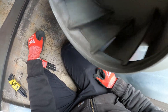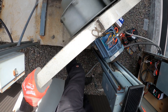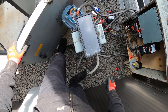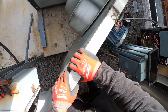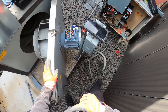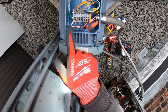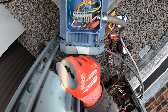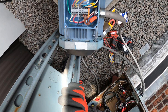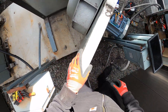Let's flip the switch and see what happens. Let's shut that down — make sure nothing scratches. Now that's a beautiful thing. You always want to make sure the rotation is correct. If the rotation was not correct, you would reverse any two wires. So let's give an example: if the white goes to U1 and the red goes to V1, you're going to put the red where the white wire was and the white where the red was — right there you've reversed the polarity and you're going to reverse the rotation. From here we're just going to close everything up. This was a beautiful job.